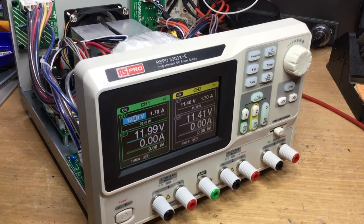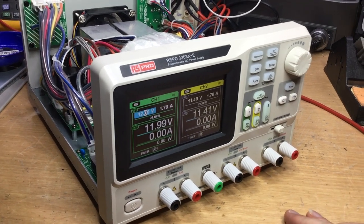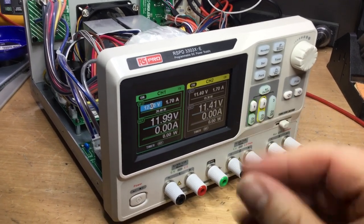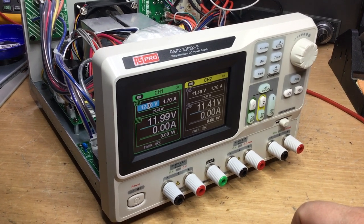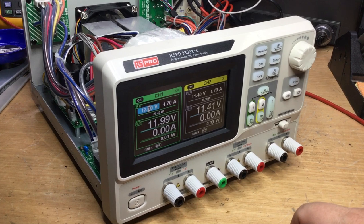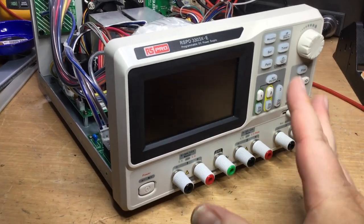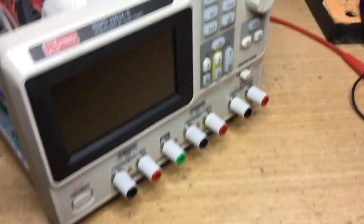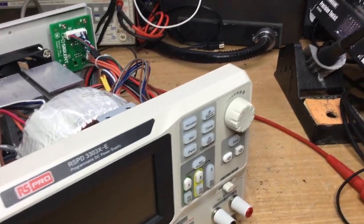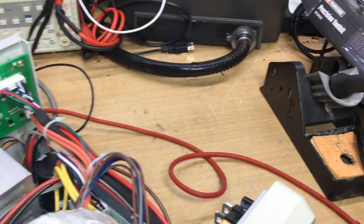So I think as the temperature increases on that bridge rectifier, there'll come a point, if it is that, which I think it is, because we just cooled it off using the circuit freezer. Yeah, it's gone. So I'm going to leave it now, and then spray circuit freezer again on that component. I'll just find the location of the bridge rectifier again, which is down there where those... Oh, it's come back by itself, look.